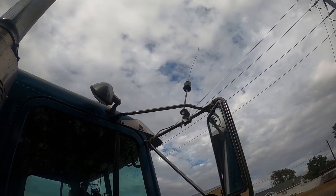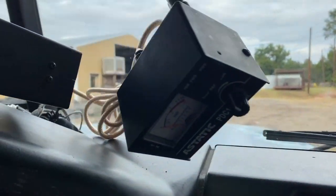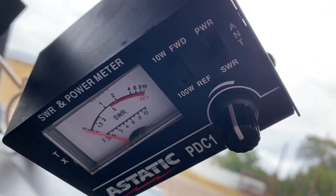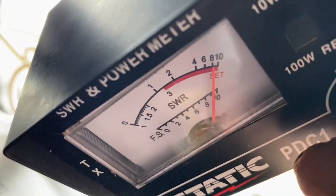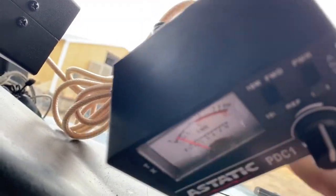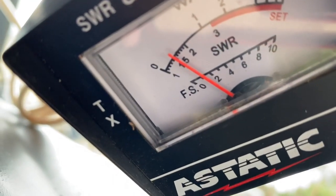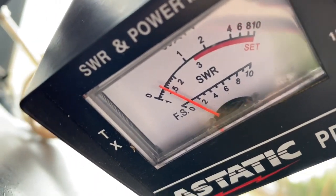We got her moved out about six to eight inches and leaned forward. Let's go see what we got. Back to channel 1, 10-watt forward. Key the mic. Now turn the needle until we're right on the set mark. Switch back to the 100-watt position and take our SWR reading — we are right at 1.5 right there. Remember a while ago we were at 2, so that made a hell of a difference.